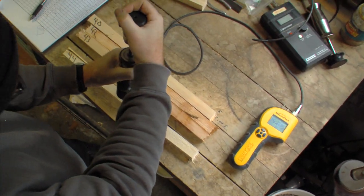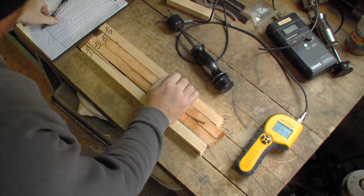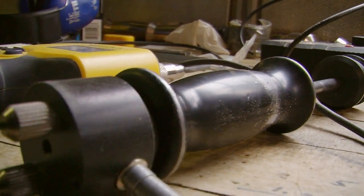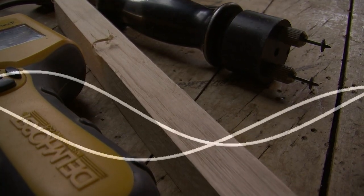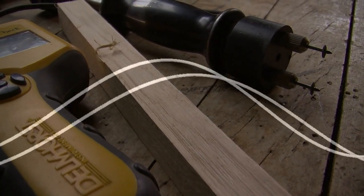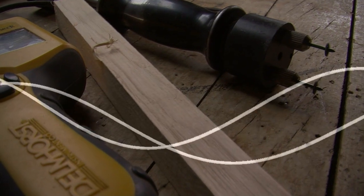There's a person whose job it is to check the moisture. The kiln operator uses a moisture meter to measure the moisture content of samples taken from various places within the kiln. Depending on the results, the operator adjusts the kiln schedule to make sure the wood is dried perfectly, checking by inserting a gauge into one of the planks while it's still in the kiln. Moisture meters work by measuring the electrical resistance between two metal prongs driven into a piece of wood — the lower the moisture content, the higher the resistance.